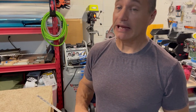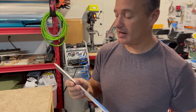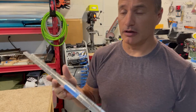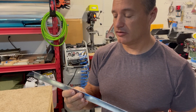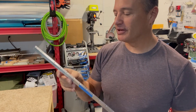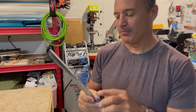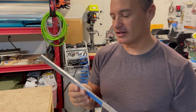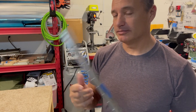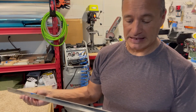I know this isn't the first time I've said it, and it certainly won't be the last, but I made a little mistake, as happens. I had to countersink all these holes for the trim tab hinge, and that all went fine - it was perfect. And then I decided to just deburr the backs of them just a little bit. Unfortunately, it's really thin material, and after you've countersunk it, if you deburr even one small little pass on the backside of the hole, you enlarge the holes.